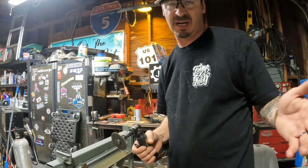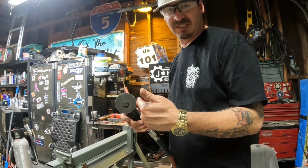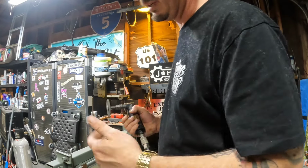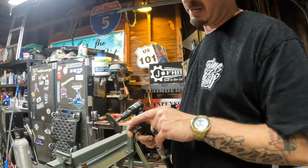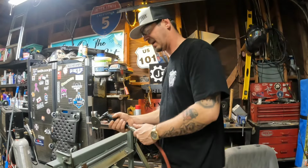So if you ever seen me cut stuff on the channel, I'm always using this side of the wheel, not this side. It's just a rule of thumb that I've always done. I do it sometimes, but when I'm cutting stuff, I generally don't like to use this side, because that's when you get that bam, that kickback.